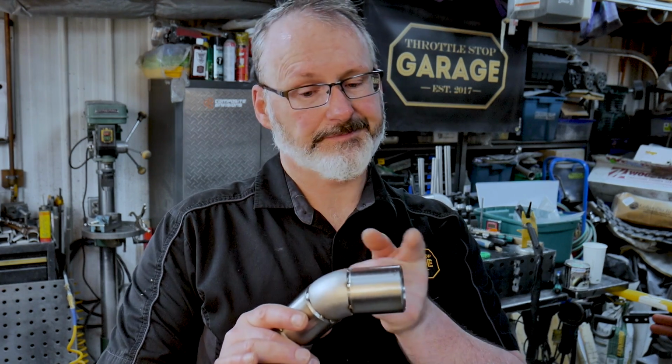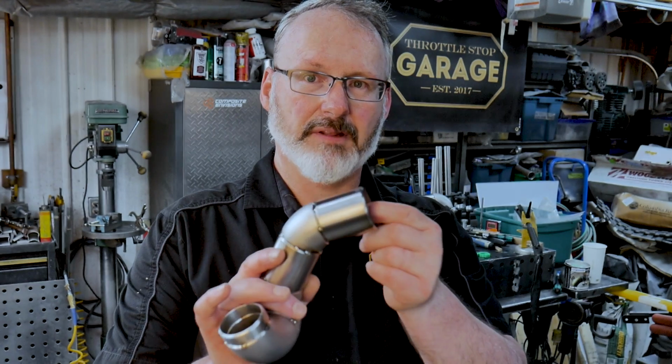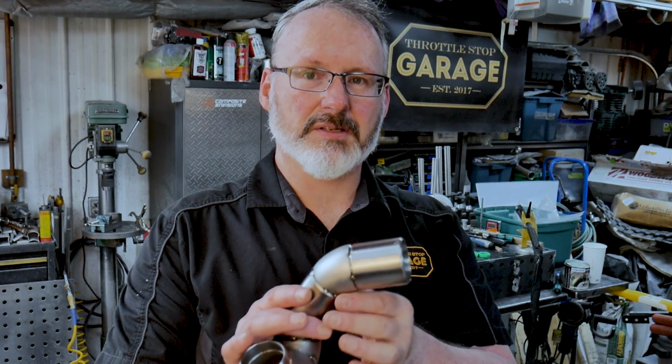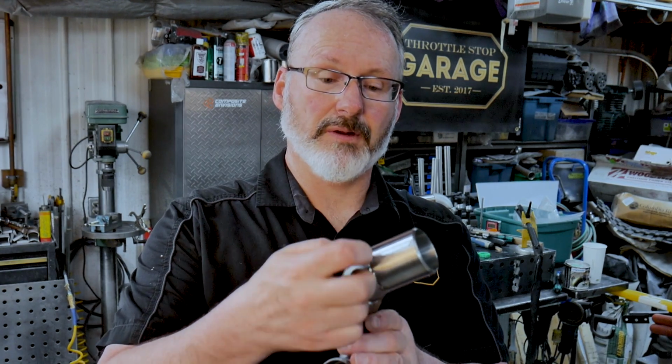It's only a little under 1/8 of an inch thick, so a little under 3 mil thick for the thickness of the pipe. But for those of us that don't do this all the time, it is more challenging to do it in a single pass. Just simply would be quicker. So we're going to do it in 2 passes. So we're going to put a root pass in where we're simply going to fuse the root.